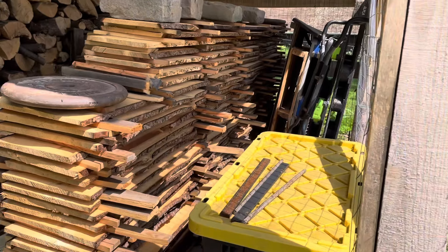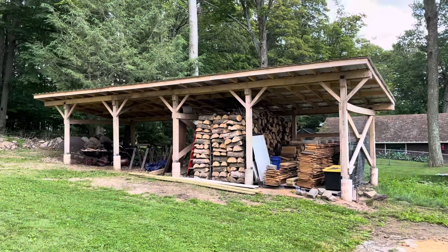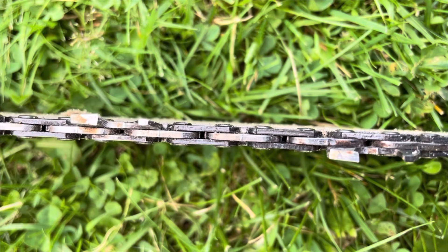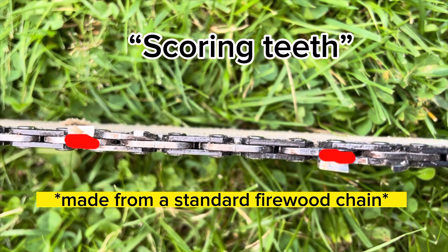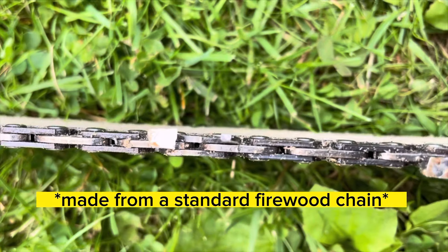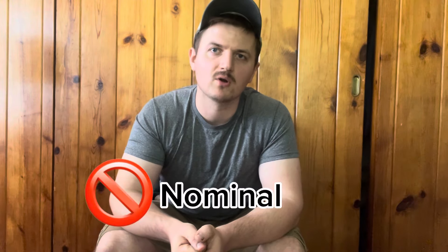My fourth point is that chainsaw lumber has a reputation for being low quality — that is not true. If you take your time and measure twice to cut once, you can make beautiful lumber with a chainsaw, especially if you're using a proper milling chain that doesn't leave a nasty kerf. You can mill with a cross-cut chain that has a 30–35 degree angle on the teeth, but you'll get uglier lumber with a heavier kerf. I like to make my milling chains to 10 degrees. This milling chain incorporates two scoring teeth — I removed the red portion with an angle grinder to make the teeth half as thick — then two clearing teeth, all filed to 10 degrees, made from a standard cross-cut firewood chain.